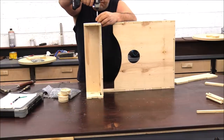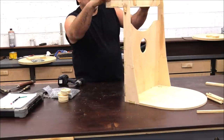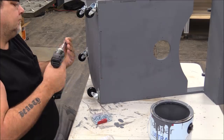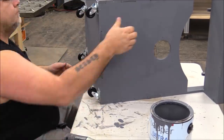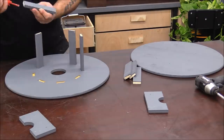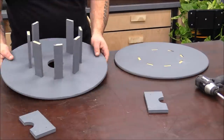The base holds the shop vac and you can store all the little accessories in the upper tray I'm building. There's a little hole in the back for the hose to go through to the hose reel on the back. I'm designing it so you can use the wheels that come right off the shop vac, so you don't have to buy casters. You can use casters if you want a taller option for rougher floors, but for the most part I'd like it to be as inexpensive as possible by reusing the shop vac's existing wheels.